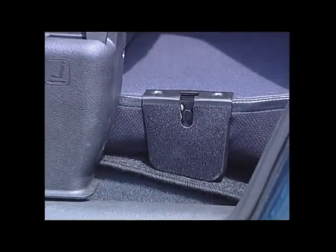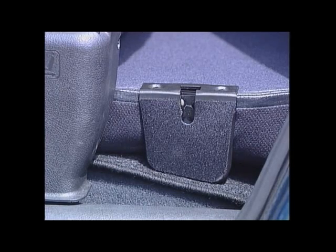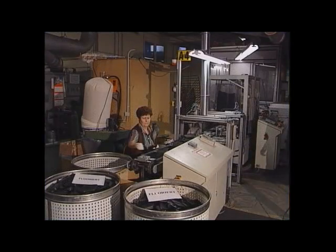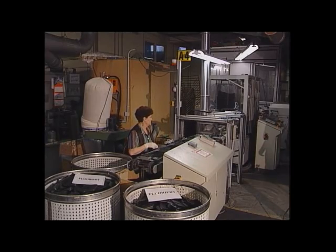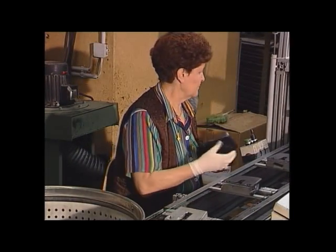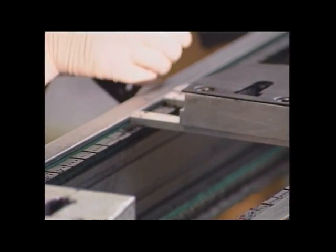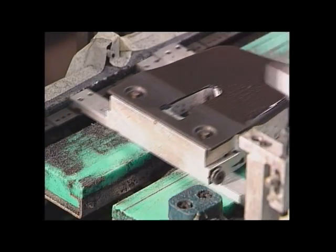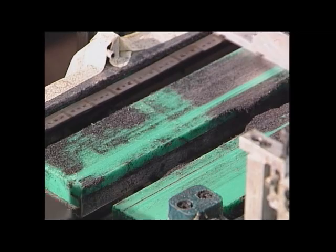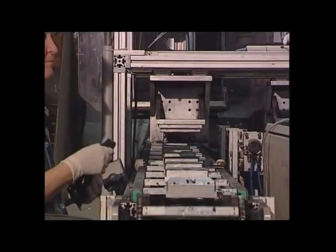Nowadays flock has become an integrated part of the automotive industry, where large series are always produced, requiring specially made production machinery. In this illustration, the side covers are firstly treated with primer and placed into the feed unit of the automatic line. A special pad system automatically applies the adhesive, immediately after which the flocking is carried out, usually also automatically.